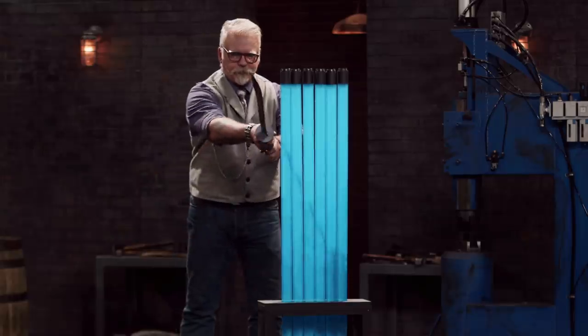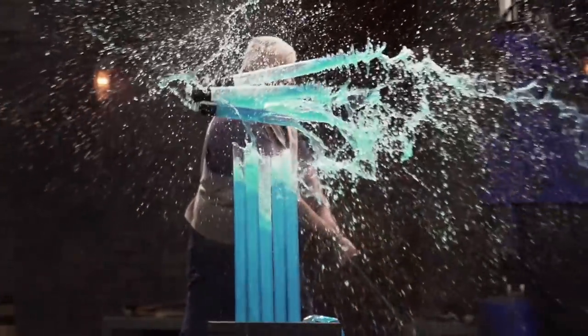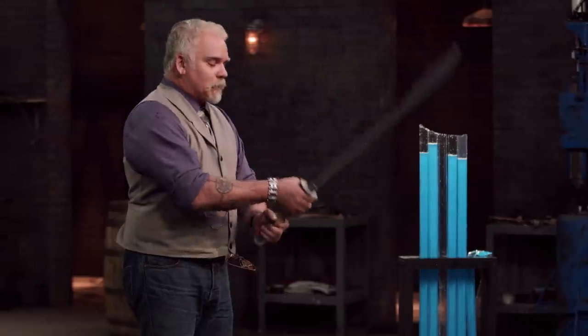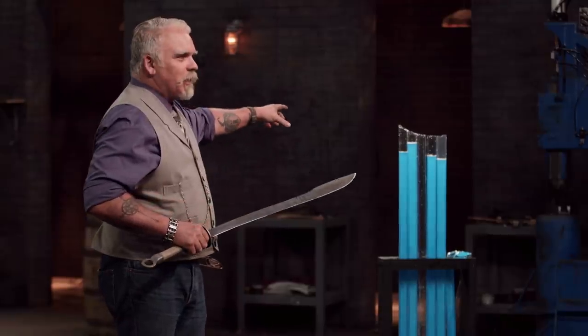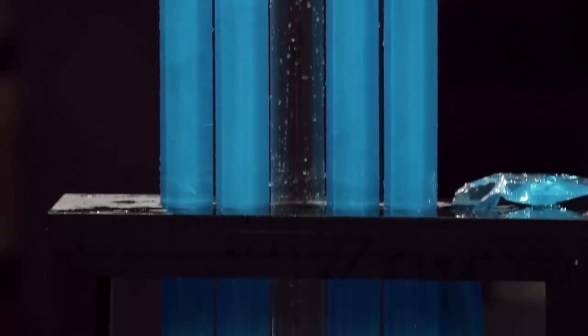Next up is a sharpness test. To test the edge of your blade and see if it's retained that edge, I'll be cutting through these water tubes. Joe, Casey, your sword has a great feel to it. I like the shape of the grip, but there's that section where that edge is rolled, and that's where the cut started. You can see that first tube kind of crushed, then it starts to cut as I get up into the sharper section. By then everything had pushed over, and it kind of crushed that last tube. It's a beautiful piece — well done.